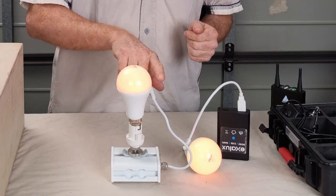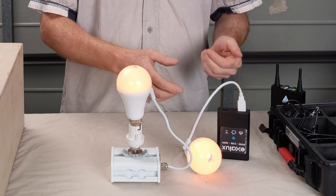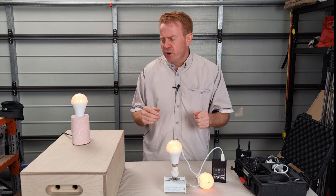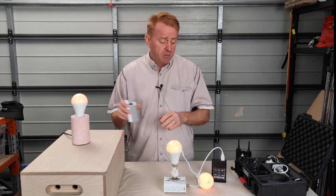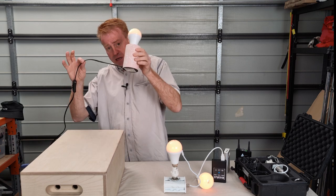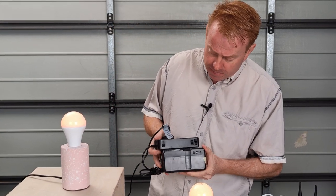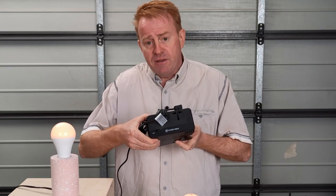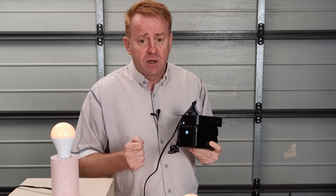You can run these off batteries via the DC inlet — off the controller for about three hours, off a USB battery pack, or even off a D-tap since it accepts 5 to 18 volts in. But none of those options work well inside a lampshade. The battery solution I'm using on set is a little inverter system that runs off a V-mount battery, made by Tether Tools — I have a separate video on that, link below. The downside is it has a cooling fan that sounds like a jumbo jet taking off about once every five minutes.